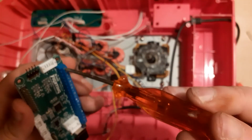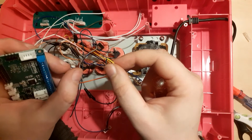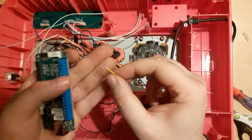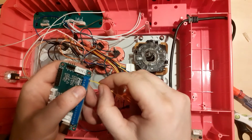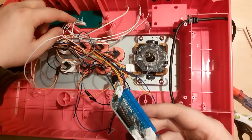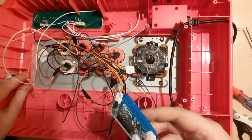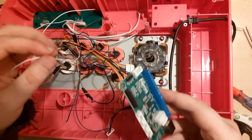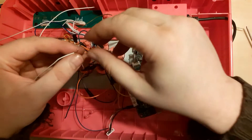If it doesn't slide in, use the small screwdriver to loosen the screw. Twirl the exposed wire and fashion a little hook out of it, then screw it into the terminal tightly. Try to pull on the wire to make sure it's secured. Now let's move on to the second ground — the one that comes from your options buttons plus standalone start button. We twirled them together before. Repeat the process and stick it into another terminal labeled GND. It doesn't matter which one.